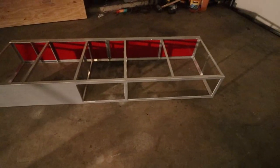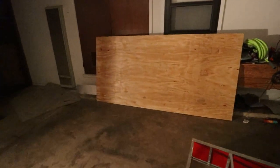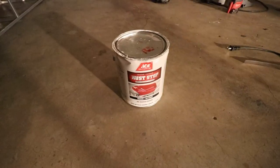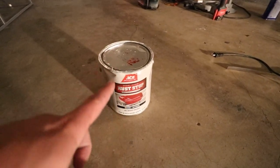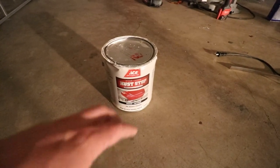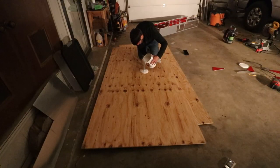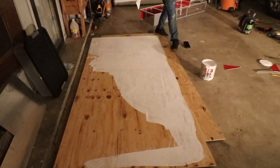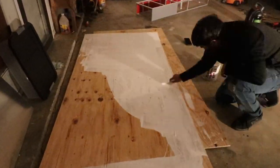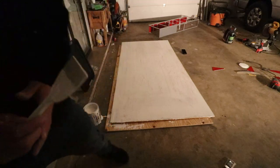I got the foam added — looks pretty good. That is going to look a whole lot better than the ugly metal that was on there. I'm also going to be painting this plywood white. I've got some oil-based enamel — same stuff I use on my john boat. If you want to waterproof any type of wood, oil-based enamel, do three coats, and it will not ever fade, and it will not ever get water rot. I want to get some paint on it to protect it somewhat.